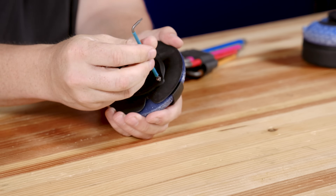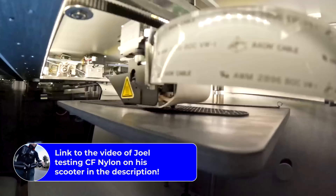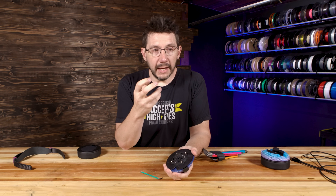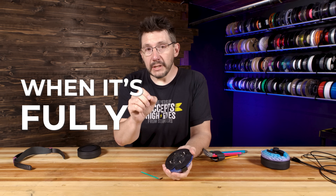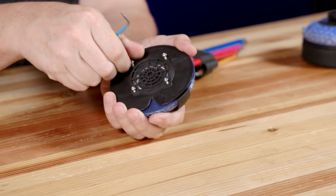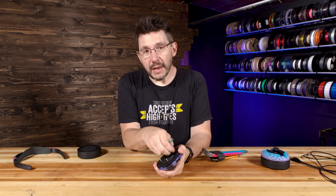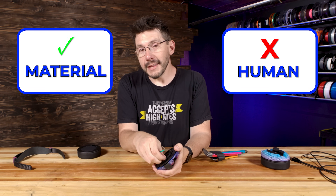When we talk about carbon fiber nylons, especially materials from Markforged such as their Onyx, they are fantastic for jigs and assembly lines. It's a nylon base with carbon fiber in it to make it stiffer. That nylon makes it nice and strong — in manufacturing it's a wonderful material. But when it's fully supported, that's the key. Here in this Hedamame headphone, it wasn't fully supported, and that's why it migrated over time and failed. It's not a failure in the material; it's a failure in the material choice — and the person that made that material choice is me.